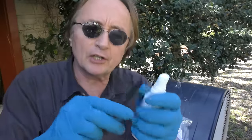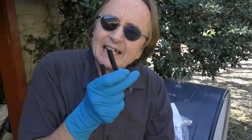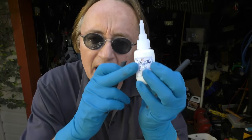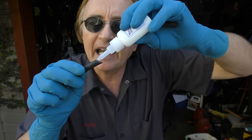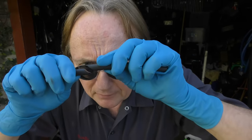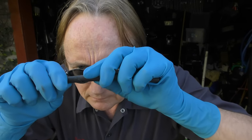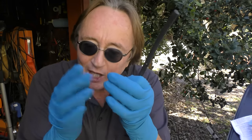If you're gluing rubber parts together, you have this activator and you spray it on one end, then let it dry. It doesn't take that long to dry, but I like being conservative so I wait a couple of minutes. Then I use the S1 super glue blue — it's the medium range one — and I put it on the opposite end of the rubber. Then you hold both ends together. I'm using gloves; you don't want to get super glue on your fingers and let them stick together, so wear gloves.